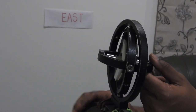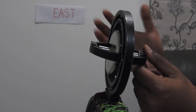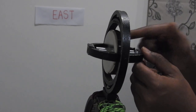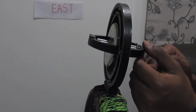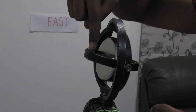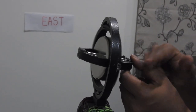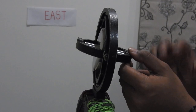However, the gyroscope drifts out of that direction because it is placed on the earth's surface. The earth is slowly revolving around its axis, which creates Coriolis force. Additionally, the ship is moving and interacting with seawater, producing hydrodynamic forces. So many forces act on the gyroscope, causing it to precess. Precession means that if a force is applied in one direction, the gyroscope moves 90 degrees away from the direction of that force.